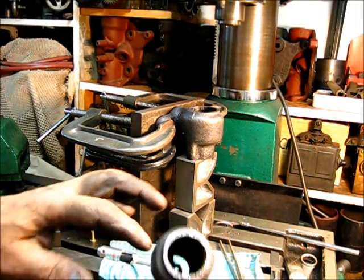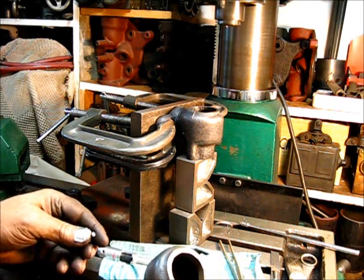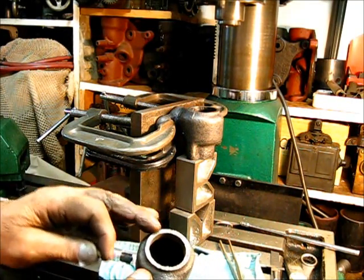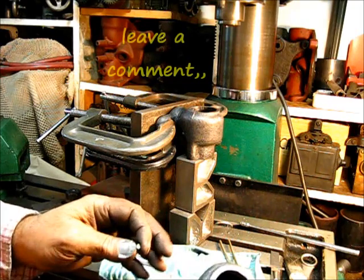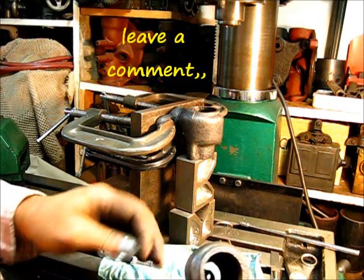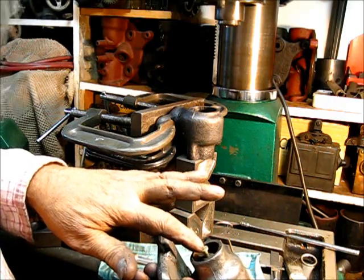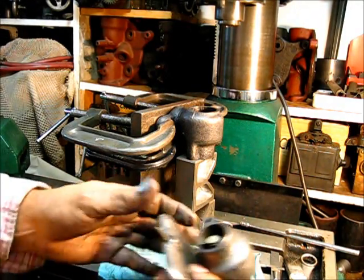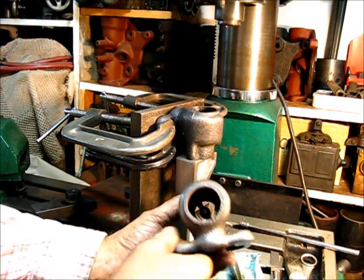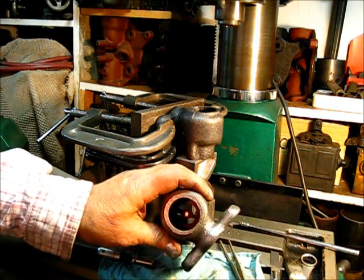I think that's the measurement you need to maintain in order for the spring to have the correct tension. With that said, and the measurements being iffy at best, to go from nothing — a regular size hole — and try to get thousandths, it's kind of useless. So what I came up with is a tight-fitting rivet that will fit in that hole, just push right in there. And if you look down in this hole here on this side, you can see the end of the rivet down in there.